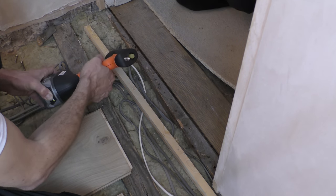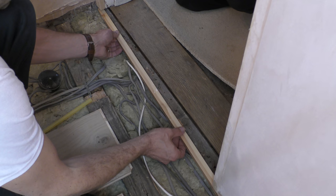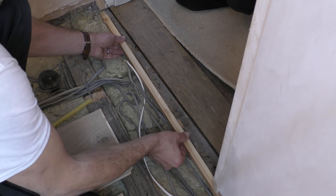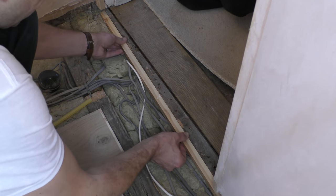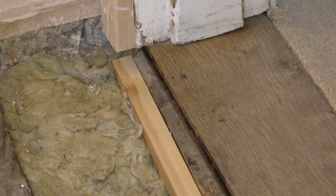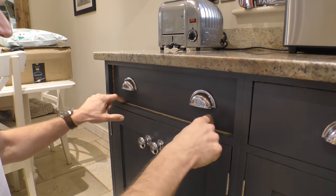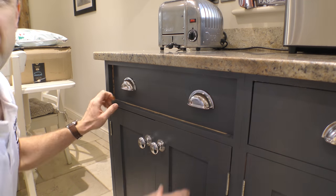Again on the same room, I made a new door tread which links in by tongue and groove to the floorboards, and a little strengthening strip which wasn't strictly speaking necessary because of the tongue and grooving. The offset bit was fantastic because it enabled me to screw my new strengthening strip in at 90 degrees to the joist rather than at an angle, which would have pulled the strip down to the wrong height as I tightened it.